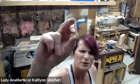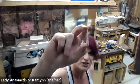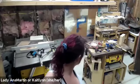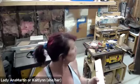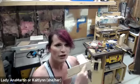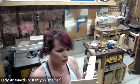This is a Miller dowel. It's a hardwood dowel that's stepped. It's got these grooves in it for glue. I should have glued it when I did it. They're middling price. You wouldn't want to do the whole thing. You wouldn't want to build a house out of it or anything. They come in different sizes. These are the smallest size. I have some bigger ones that are 3 inches long or so. But they end up looking like you've pegged the joint, even though it's a really strong glue joint.